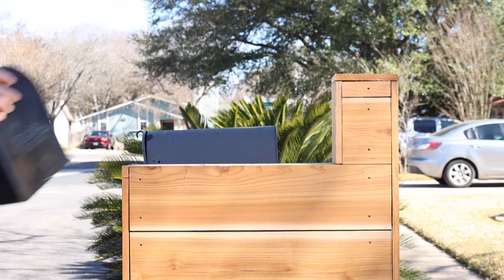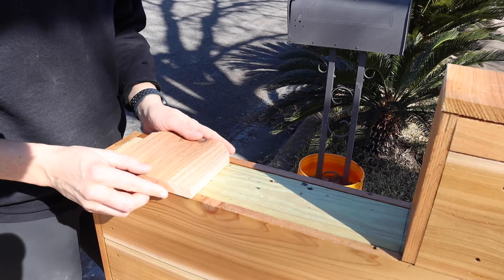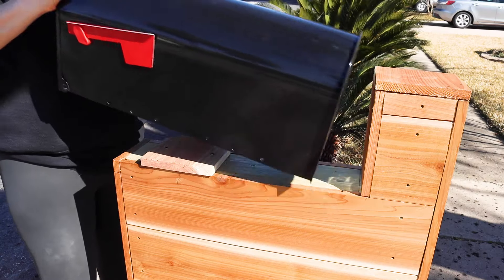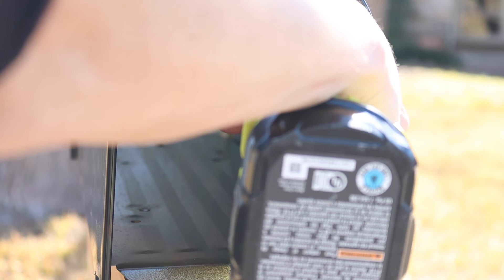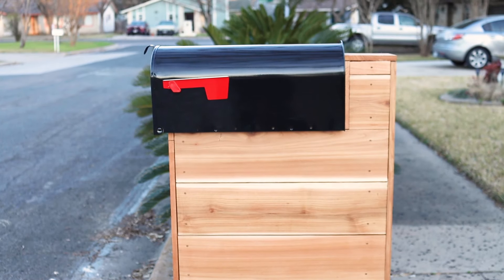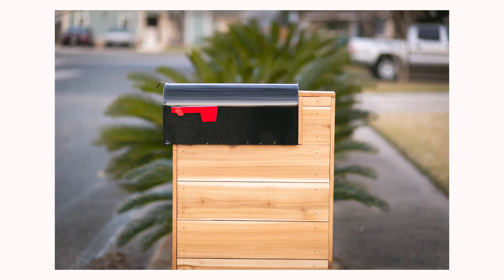This particular mailbox is made with a recessed area in the bottom, preventing it from sitting level on my base — the back lip sits on the surface and the front lands in the recessed area. To fix this, I screwed in a scrap at the front that will never be seen and will push it back into level. Finally, to attach the mailbox, I grabbed my slim right angle drill and screwed the box to the base. And with that, this modern mailbox was done. Building this modern mailbox was definitely a huge upgrade — our curb appeal just went way up and it looks like a pro build.